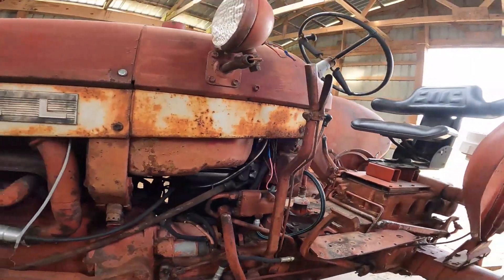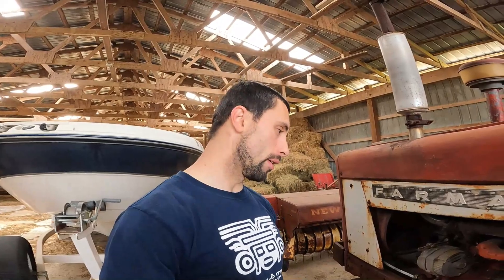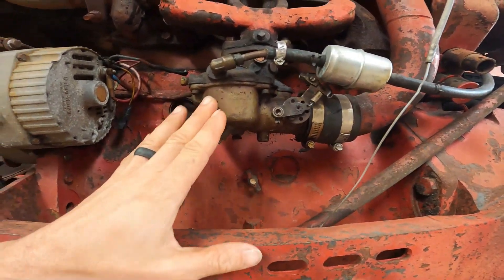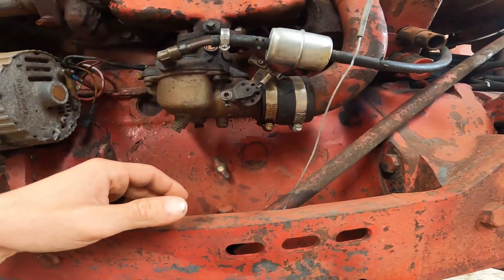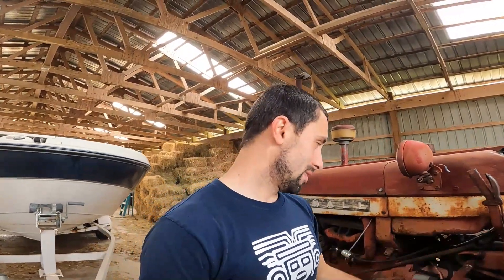Instead of using the Coyote tractor, now that we have our own tractor, the last time I used this — in the previous video when we hooked up the hay bine to test run it — for whatever reason the fuel just started pouring out of the bottom of the carburetor. I'm guessing the seat is stuck or something with the needle or float. There could be junk in there, so I'm going to pop the carburetor bowl off, clean it out, and hopefully that solves it. We need this for hay season.